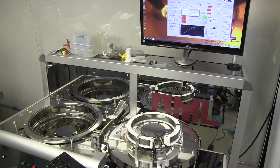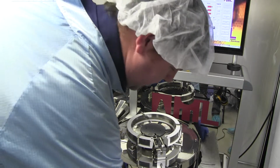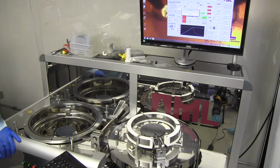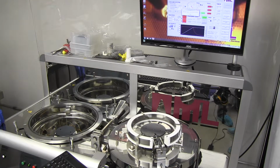Combine your 2 methods if you like. We do room temperature annealing for 4 days. We just keep it at room temperature. Really? Yeah. We have cavities, and if we just anneal it, the cavities will expand and then open up. I don't understand how annealing is going to work at room temperature. It needs the energy, it needs the heat to actually overcome the activation barrier to get that chemistry to happen. So I don't quite see how your annealing is working at room temperature. I think it's just to somehow remove the hydrogen maybe, and then we do a high temperature with less than 1 degree per minute.